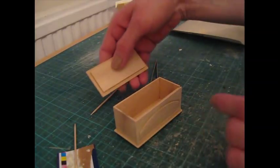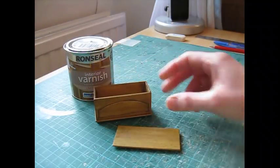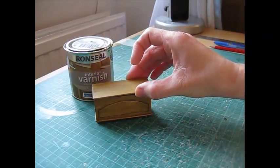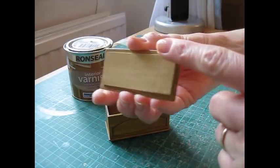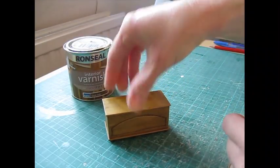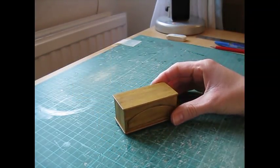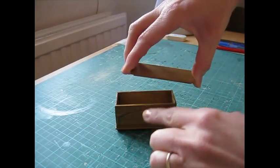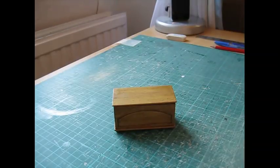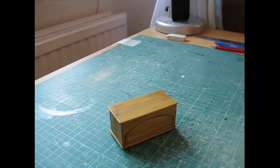Remove the lid and varnish inside as well. The chest has now had two coats of varnish on the outside and a single coat on the inside and on the underside of the lid. When you come to replace your lid, if it's a little bit too tight just go with a piece of sandpaper around the outside of the insert to sand a bit off, and then it should fit in quite nicely. That's our completed blanket box — it will sit nicely at the end of a double or single bed, and you can put a display inside with a few blankets hanging over the edge and the lid laid back on top. I hope you've enjoyed this project — please do subscribe to the channel as I've got lots more to come. Thank you for watching!